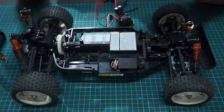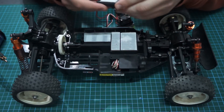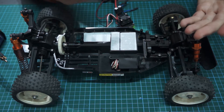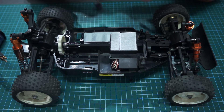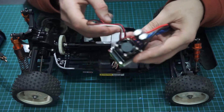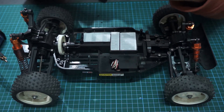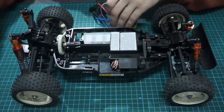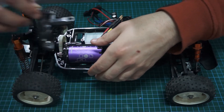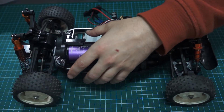What I like to do is — I've already pre-put velcro down here. I like to use velcro because then I can move things about as I please. If the position's not right I can always move it, and obviously I can peel these off and put them on other projects if I need to. Here we've got the speed controller — we'll get this guy on. Actually, let's bolt the motor down first so we can see the position of the wires, and then we'll take it from there. We'll get the motor cover in and screw her down.